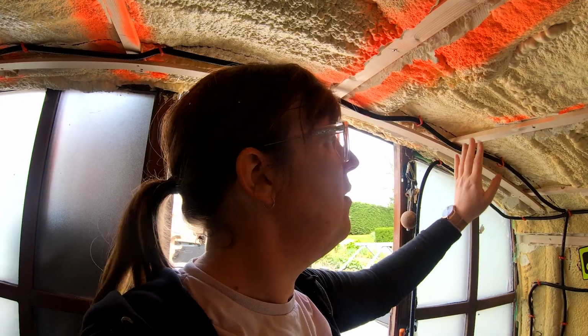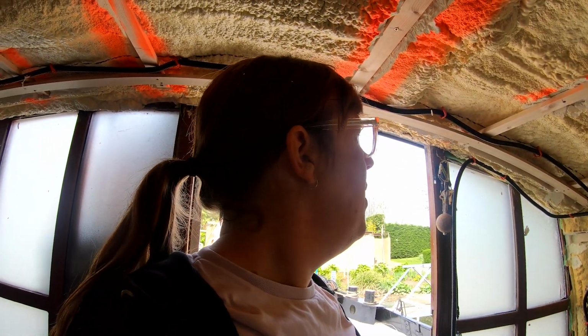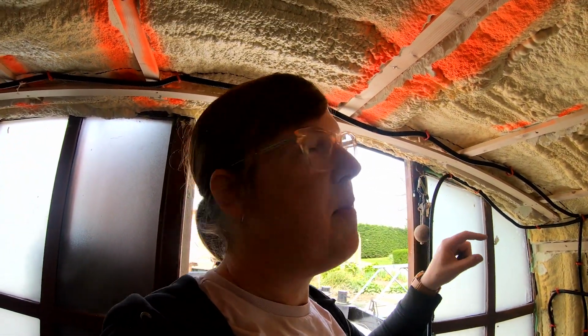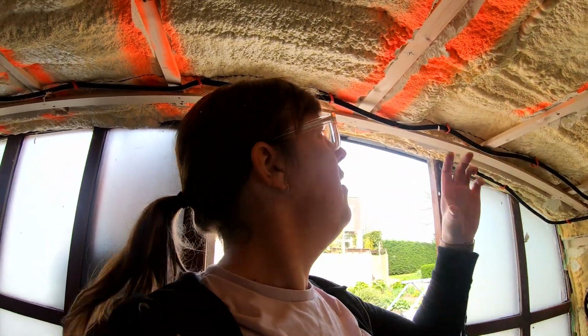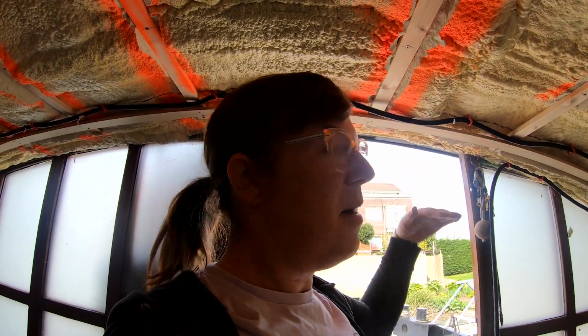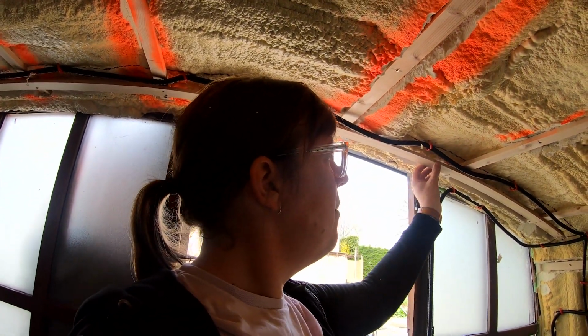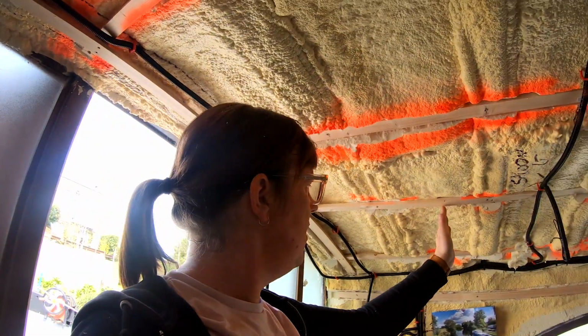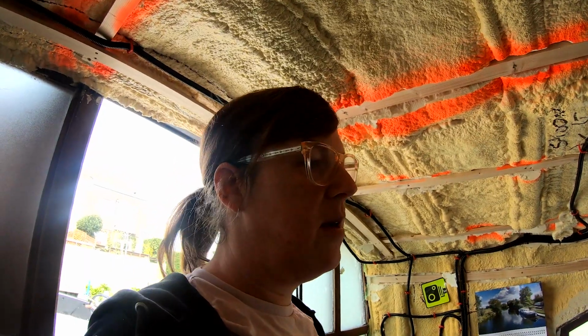So it's not like a floor or something, it's just a suspended ceiling kind of thing. So I think that's going to be enough. The problem is the recommendation was each batten 25 mil, so that's 25 mil, that's 50 mil, that's 75 mil, so it's like that much here. So actually I'd be really ducking down to get in, so I don't think it's needed. Yeah, these battens are going to go. I'm going to put the next one roughly here, and then keep going down.